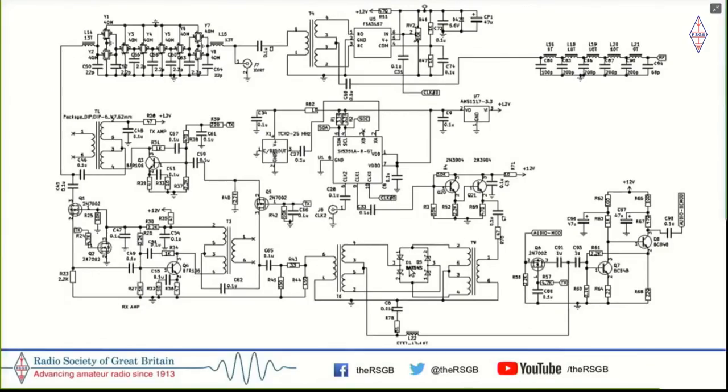And then you have detectors slash modulator. And you'll also see on the right-hand side here that there's a feedback amplifier used for the audio preamplifier, which feeds to the sound card of the Raspberry Pi. And this is a very interesting design. It was designed just a couple of months ago by Wes Hayward, in the sense that the earlier designs that we used in direct conversion radios did not have a high dynamic range in the audio preamplifier section. And this is a new design, which due to its feedback manages to lower the input impedance to exactly 50 ohms while still having a fairly high current in the transistors to be able to give a good dynamic range. And in the center of this is the SI5351, which is actually feeding both as the VFO as well as the BFO.